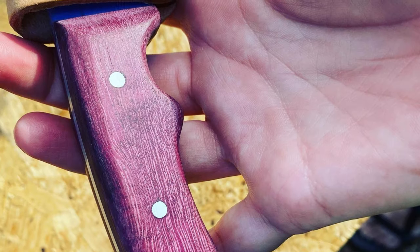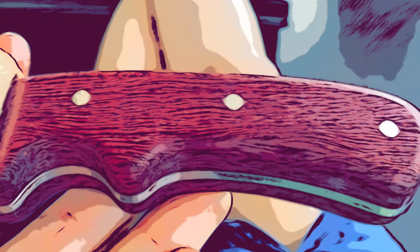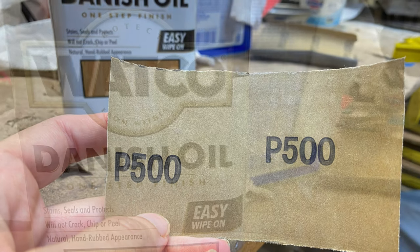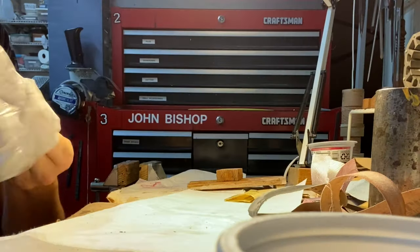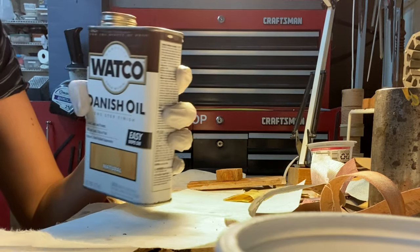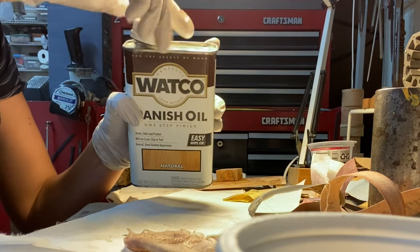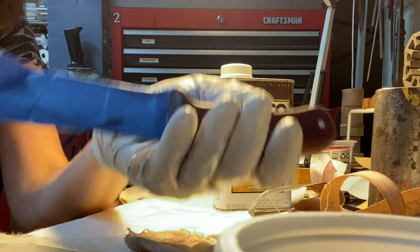The acetone helps the wood oxidize more quickly and reach its full vibrant hue as quickly as possible. Many folks polyurethane their Purple Heart to preserve the color, but I wanted a natural, non-plastic finish, so I decided to go with wet sanding using 500 and then 1000 grit sandpaper and Danish oil. For many woodworking projects I've used tung oil, but I found it would have darkened this wood too much after testing it on samples, and a woodworking forum suggested using natural color Danish oil. Here you can see my final coat after wet sanding. Wet sanding first helps incorporate all the little bits that come off into the matrix of the oil and the wood itself, making for a super soft, supple, fine polish — a really nice natural finish.